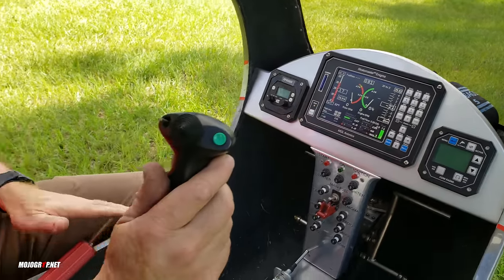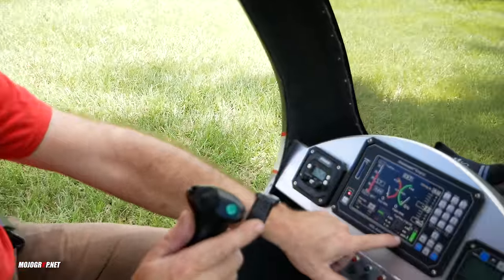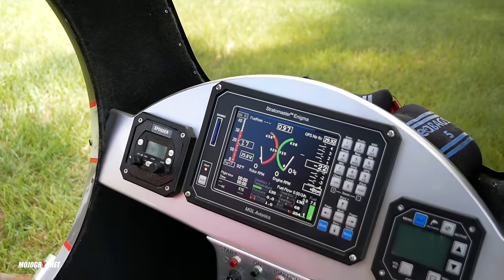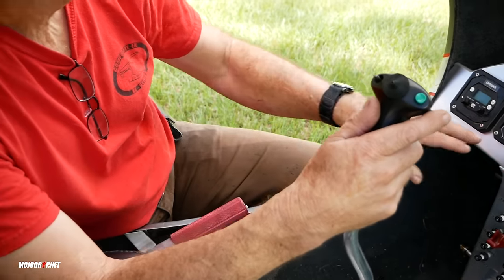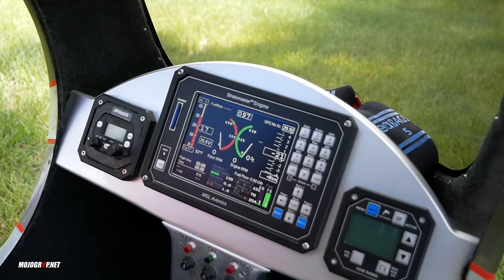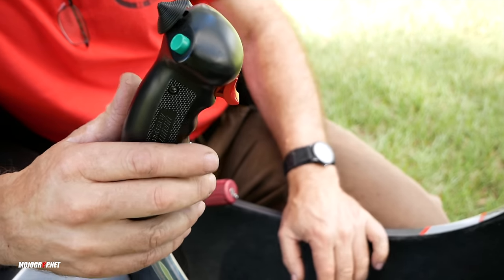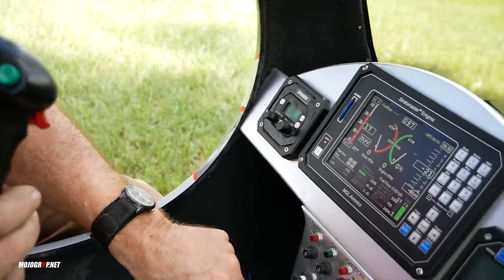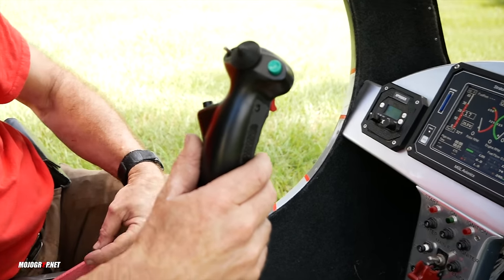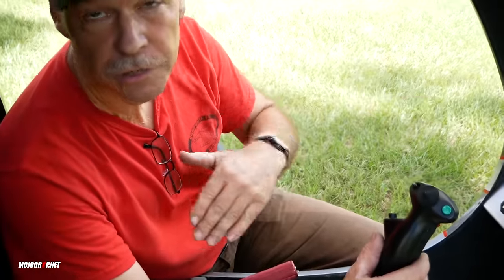So then you're going to come back to your throttle, slowly advance the throttle, watching our EGT temperatures, not to exceed 1,000 degrees. You can control that temperature by how fast or how slow you add fuel to it with your throttle. Once you have progressed to 75% on the engine, then you would turn off the igniter and the start fuel. So then at that point, the engine's running 100% off of the main fuel system. You can throttle on up to 100%. Once you lock the throttle in, the governor takes over from there. So you no longer have to do any throttling until you're ready to shut the aircraft down.